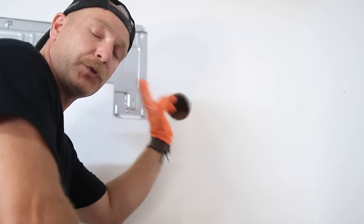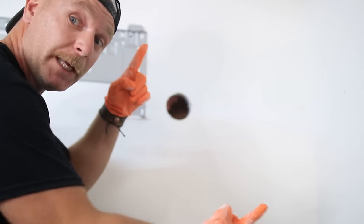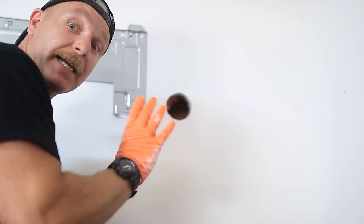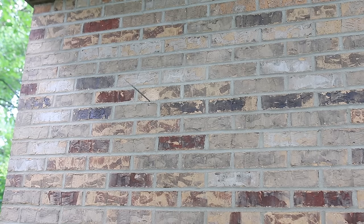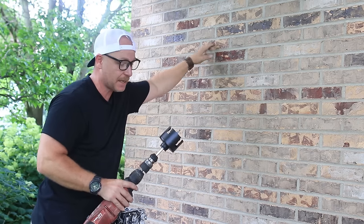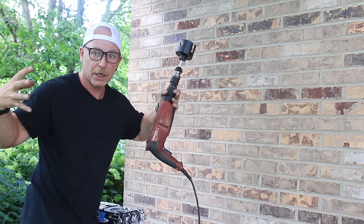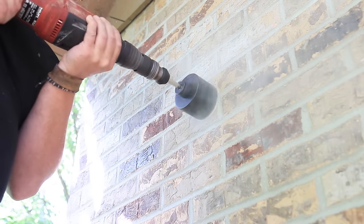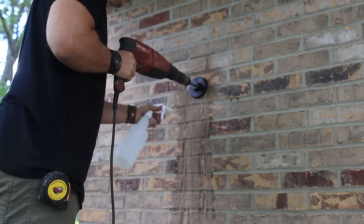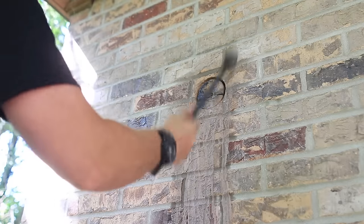I have drywall, a 2x6 wall, plywood on the other side, and then bricks. So in order to punch all the way through the brick, I needed a really long drill bit to punch through so I could guide the hole saw through from the outside in. We've punched through from the inside, and now we're going to be using a 3.5-inch masonry bit to punch through that brick so we can make the connection for all the line sets. The masonry bit will only be necessary if you're going through a masonry wall — brick, cinder block, or anything like that. If you have regular frame construction, you can just use the hole saw that came with the unit.